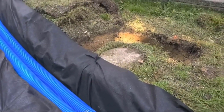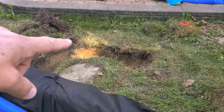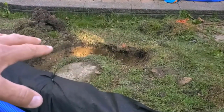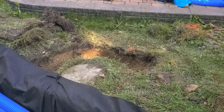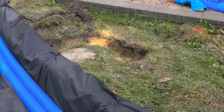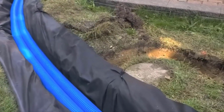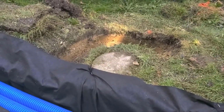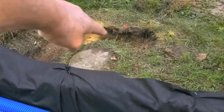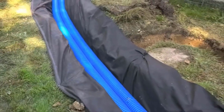We've, of course, made some changes. On top of the stone, we'll actually wrap the stone, and then we'll put a plastic grate so that you can blow the leaves off. It's actually kind of known as a trash rack. That way you're not filling the stone full of garbage. And this blind inlet will have stone, the same stone as the stone we're going to put in the French drain.